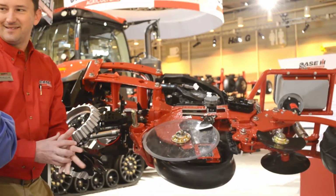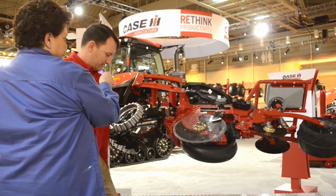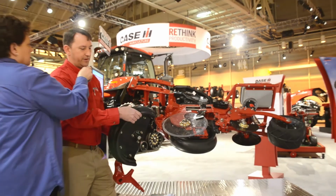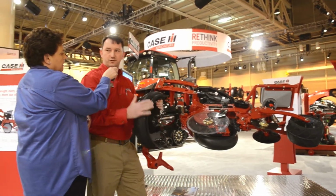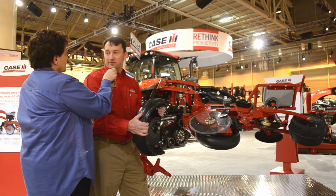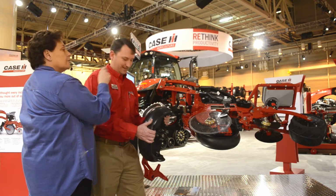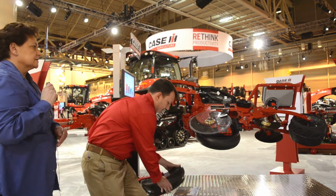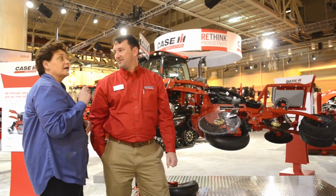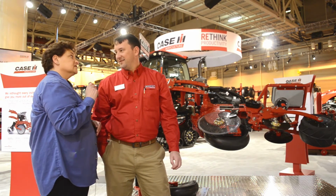And you want soil to seed contact to be paramount too. Absolutely. The other little trait here is on the gauge wheels themselves. We've got these dirt relief grooves, or this reduced inner diameter. Oh sure, it doesn't clod. What it does is it completely eliminates any sidewall compaction issues. So that's really not a concern with the Early Riser. We've lived it, we've experienced it. We never imagined that somebody would come up with solutions, because that's the kind of problem we really identify after the seed's in the ground.